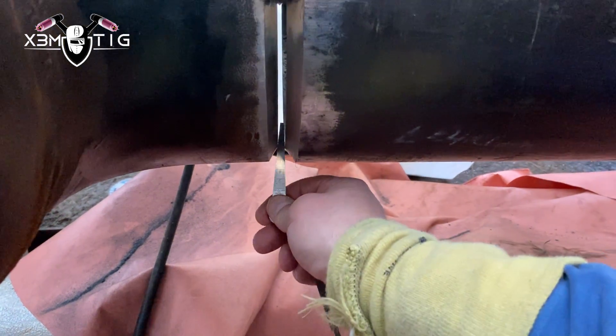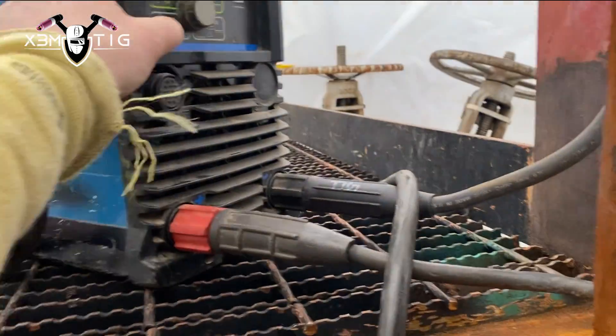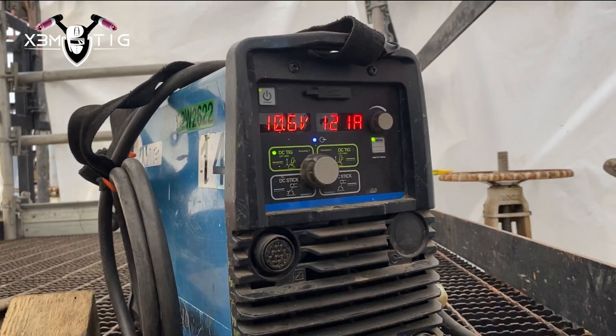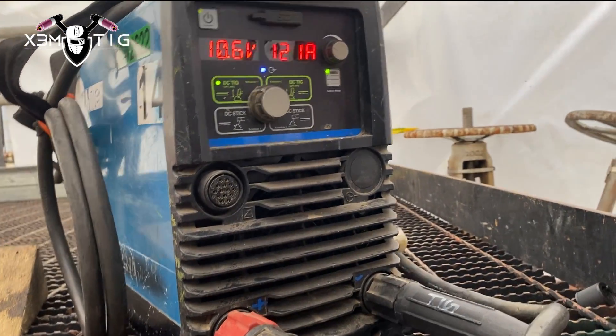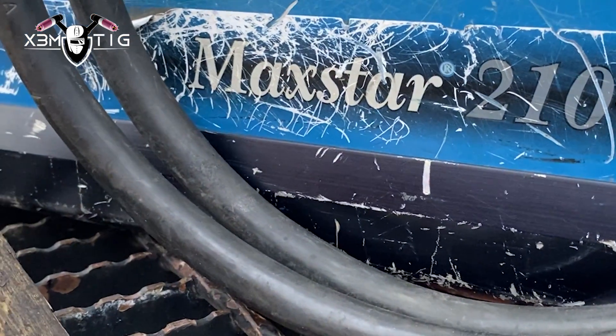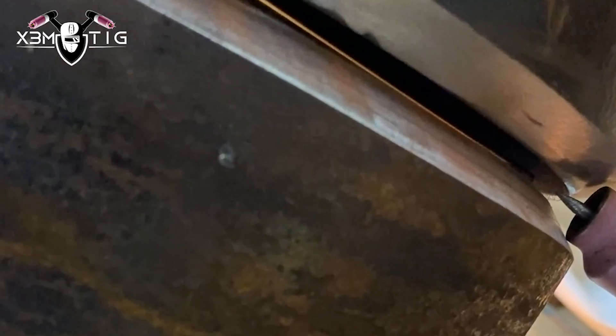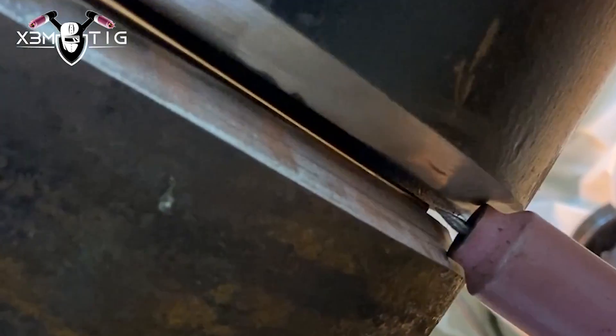I got two joints that have to be welded at the same time. I'm gonna do one side bottom-up on one joint and the same on the other. For today I'm using the Miller Maxstar 210 — a really nice welding machine. I've welded with it before, it's really reliable and handles pretty much constant work without shutting down. For the root, I'm running 120 amps and I'm gonna back-feed. The rod I'm using is 70S-2.